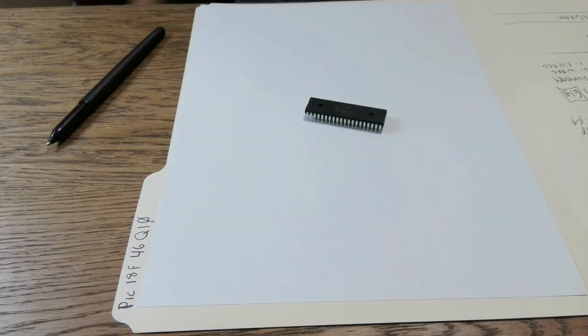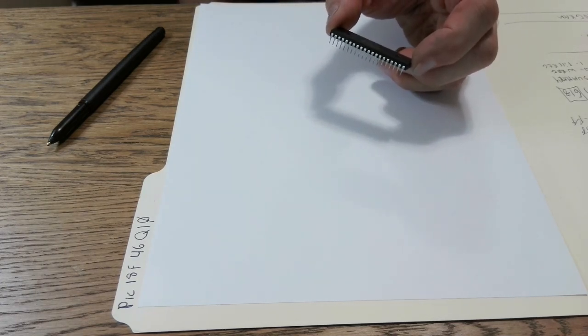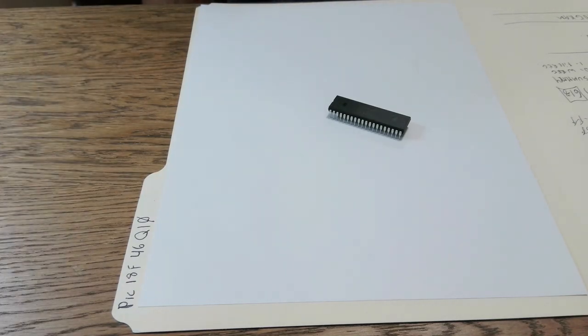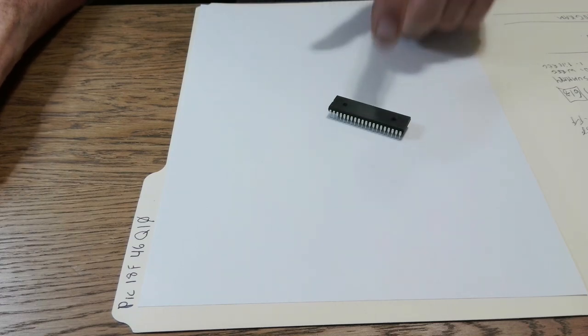This isn't really the largest chip Microchip makes. It's an 8-bit processor, but this is the largest one I can actually use. This is a 40-pin chip and as you can see it's the type that can be used in a breadboard or a perf board. The other chips, up to 100 pins, are surface mount and require special hardware. Most hobbyists do not have the hardware to make a surface mount chip work, but the 40-pin chip is as large as you can get.